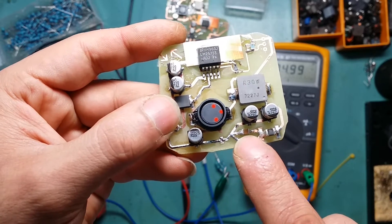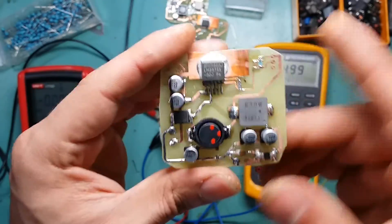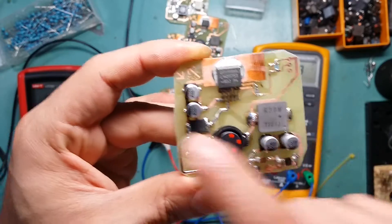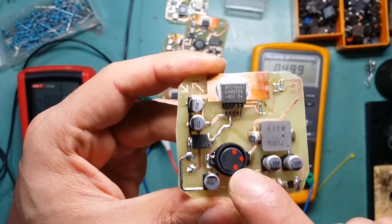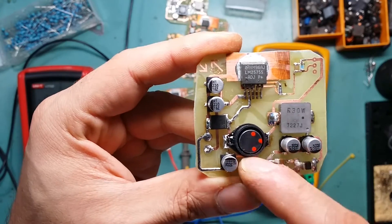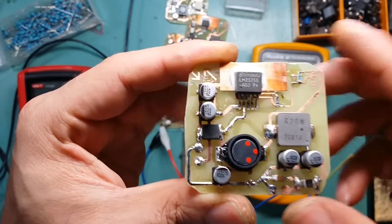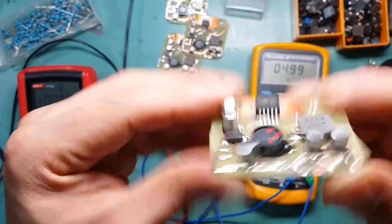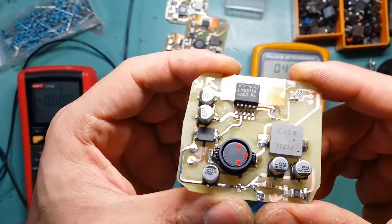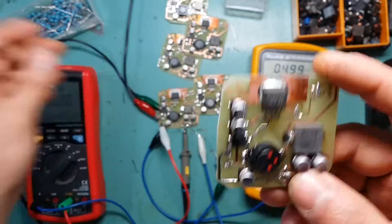Then it goes through a ferrite bead and another capacitor to the output. This took me about a day to get the output ripple really low. Initially the flux from the inductor was causing all sorts of problems in the DC-DC converter. So I moved the IC all the way up and brought the inductor all the way down so the flux doesn't reach the IC. The odd shape of the boards is because I used leftover PCBs from previous projects, cut to size — I don't want to waste any PCBs. I've got five of these, all handling up to two amps.